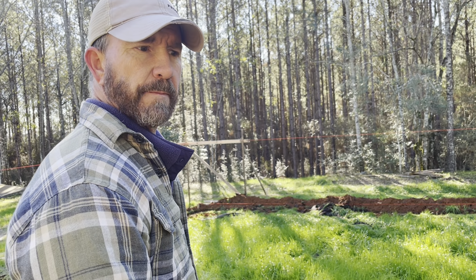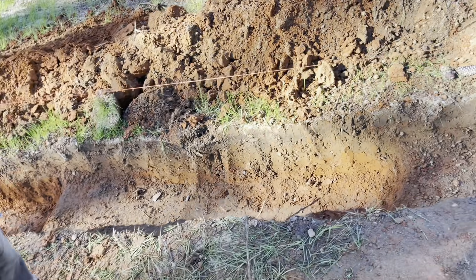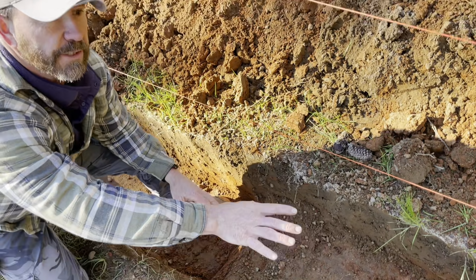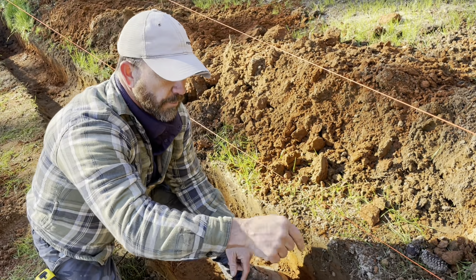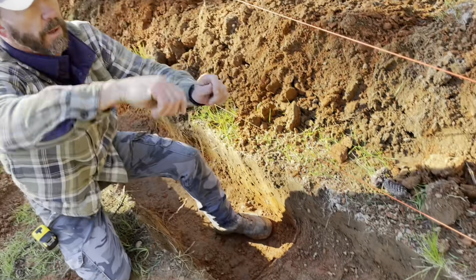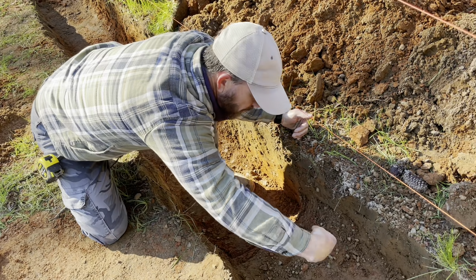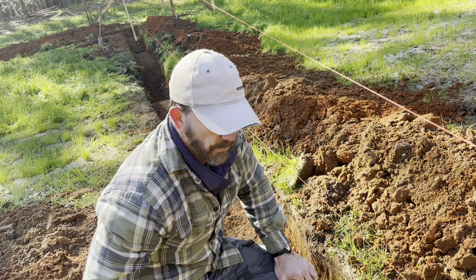You want to explain the step downs? Well, these right here are step downs in the slab. They're 16 to 18 inches wide on these footers. What I'll do is dig in right here and set a board. All of these are eight inches thick, so everything off of this string is going to be in eight-inch increments. I'll drive rebar grade stakes in so that when I'm pouring concrete I don't have to keep measuring — I'll have a grade stake sticking up and just pour the concrete right to the top of it. The board will be sitting right here. The rebar will come off the rod chairs, hook into the rod chairs and the rebar down here, and just keep going like stair-steps going straight down the hill. All of this will be eight inches thick.